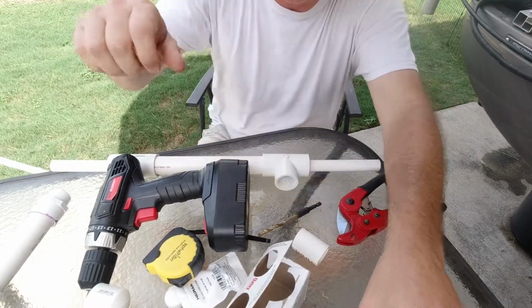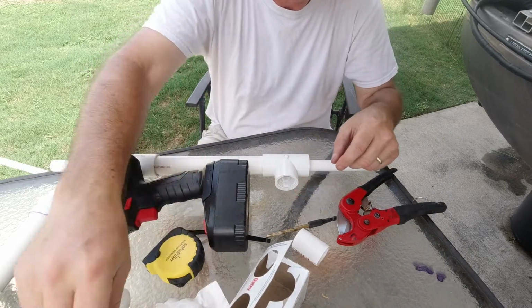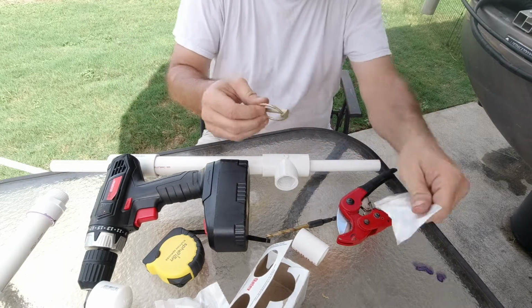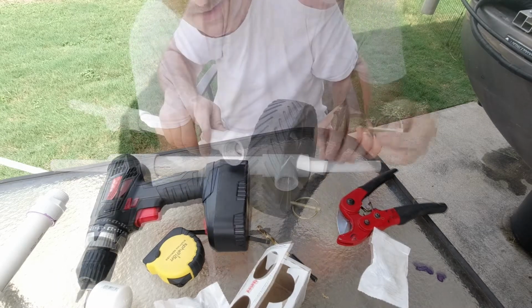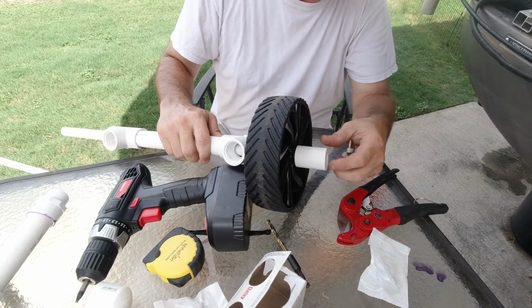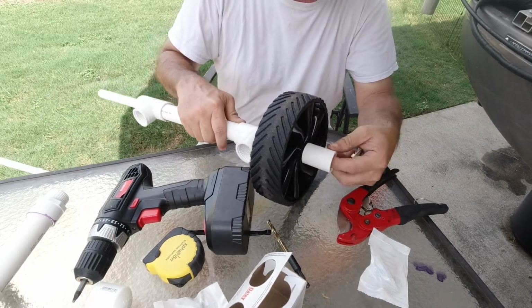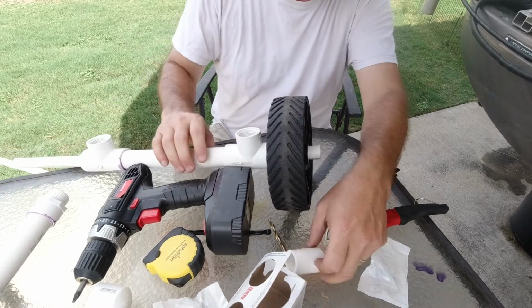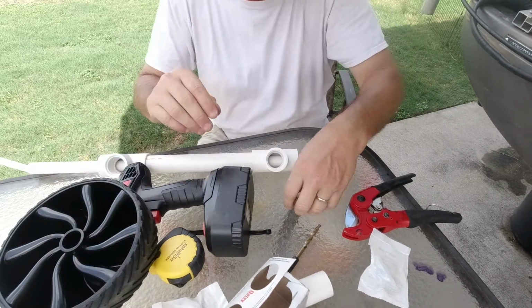The next step is the quarter inch bit. We have these ring holders here. Okay, so we got to make the bearing and go through here. So what we got to do, we're going to make another bushing out here like this and then run it, and that should be pretty good there. So we'd need to cut this in half, and that should be a good bushing enough. Okay, so that should work. So let's cut this piece in half and make it a bushing.